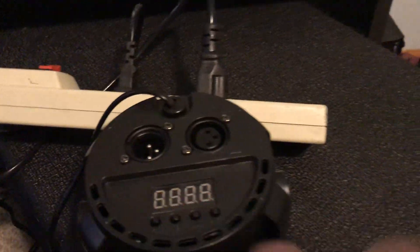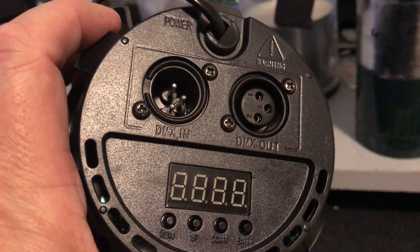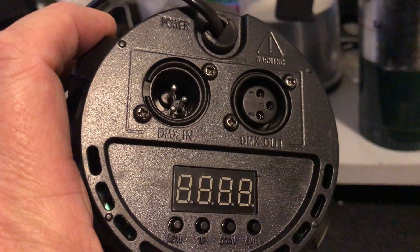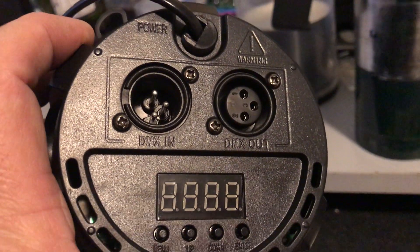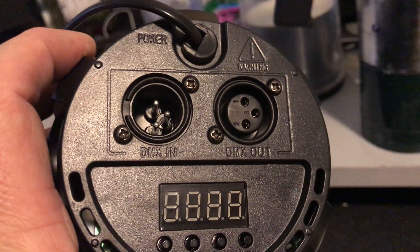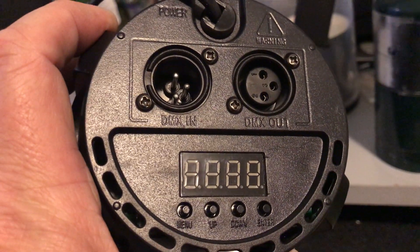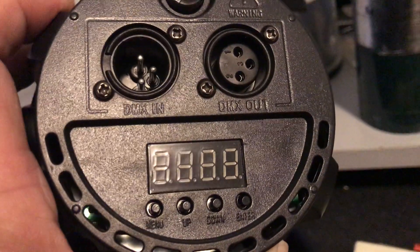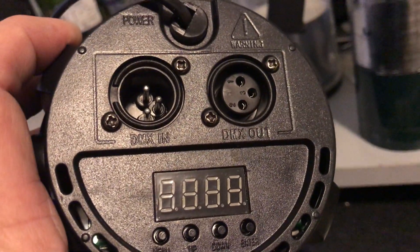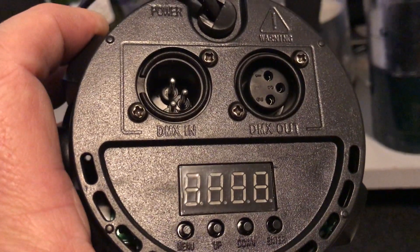It's got your places to plug in your DMX cables, which are just a microphone cable. You're going to want to go in from your DMX controller into your first light, and then you can just daisy chain them together — out of this one into the next one, out of the next one. They'll just go on forever and follow each other and copy each other, unless you tell them to do different.